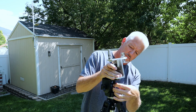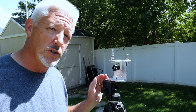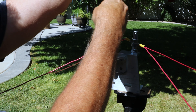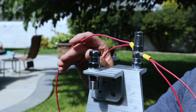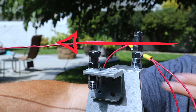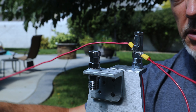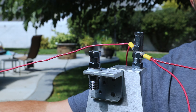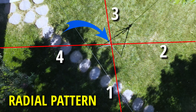I'm using the quarter-inch 20 to mount it to the top of this thing. I'm assuming you're watching this because you've never done a 20-meter vertical before or you're just curious, so that's why I'm going through these step-by-steps. With the bracket in place, we're going to put on the ground radials, and then after that we'll put on the 17-foot whip as our vertical radiating element. When locking down your radials, keep in mind the spacing: one goes one direction, the next goes 90 degrees from that, and the other two mirror them — so in the end you have a cross pattern with the antenna at the center point.